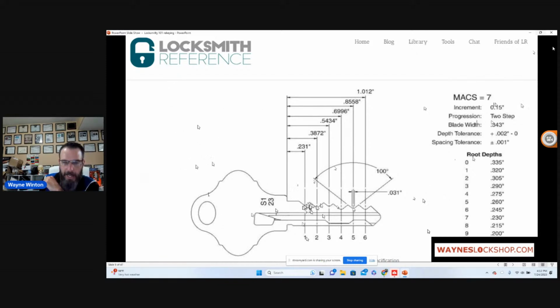Here we also have the cut angles. We've got the angles that identify the cuts. Without this angle, the key could not work with the key pins and move the key pins up and down smoothly. If the angle is too steep, the key will bind, or if the angle is not there and there's a back angle or a rake angle, the key will not either slide in nor will it come out. That is all important information.